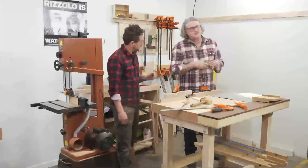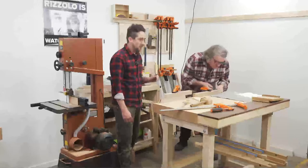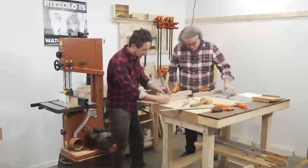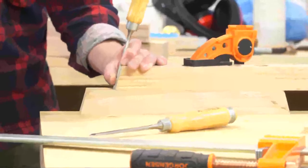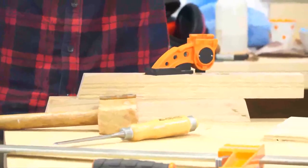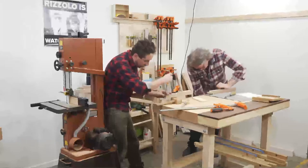The knife mark is where you do your last cut by placing the chisel in there. So yeah, don't start on that knife line. You'll be removing too much waste and your chisel will sway. So I'm going to place my smallest chisel against that guide and tap it down into that cut. Now, I don't use the largest chisel because it'll have a tendency to deflect off the timber and change angle. So I'll do one pass with that really small one.